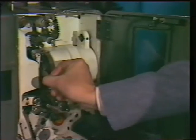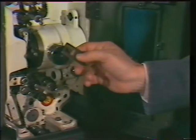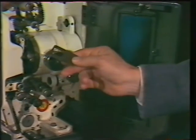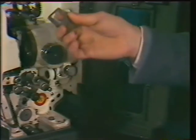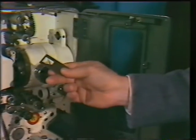You probably already have several different aperture plates for various film formats. None of them will work for 3D. The 3D image occupies more of the available area of the film than does the standard 1.33-to-1 image. There are two ways to solve this. The easiest way is to leave the aperture plate out, though on some projectors you may find you are projecting the soundtrack on the wall. The second method, while more difficult, will yield better results: obtain another 1.33 aperture plate and carefully file the aperture out to match the 3D image size. Do it once, and then you'll always have a 3D aperture plate. Remember, none of your standard aperture plates will work.